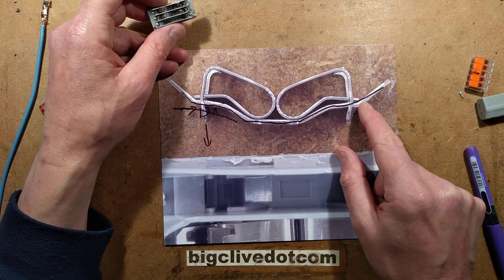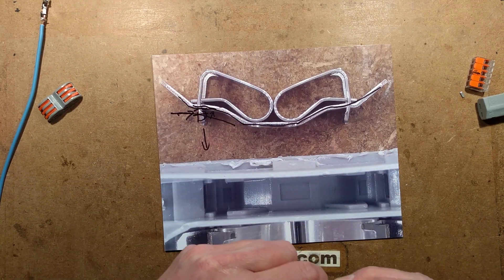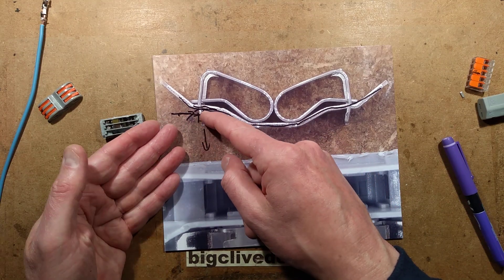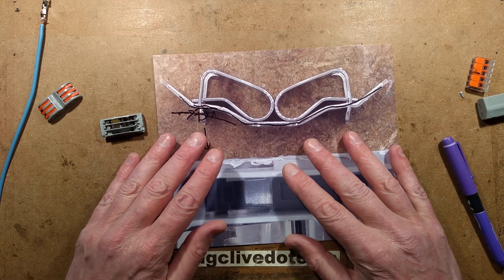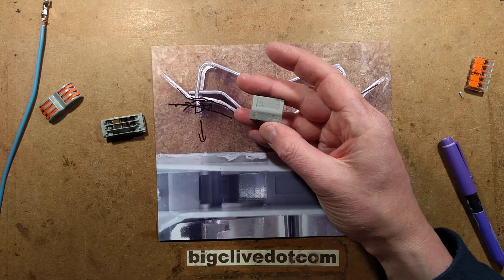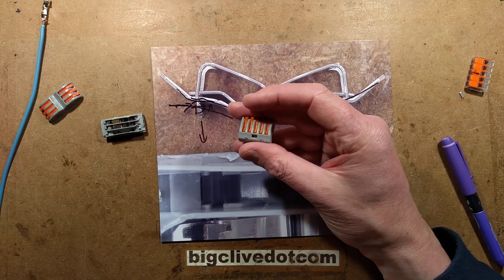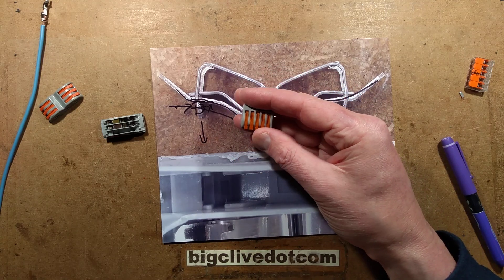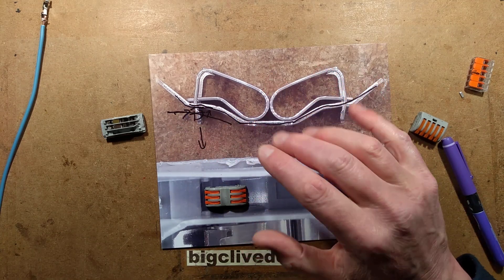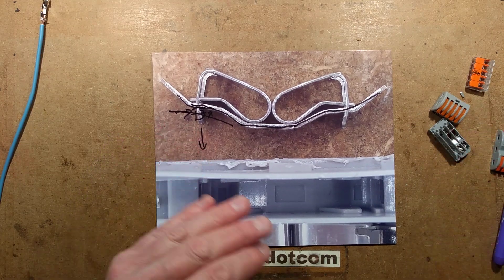It was way above the connector's rating, but it doesn't tell you the long-term story. You've got a conductor pressed against an unknown metal which has steel as a component - possibly some stainless steel variant - and you don't know how that connection is going to behave over time. An oxide or reactive layer may form between the two metals. I would always recommend that if you want to use WAGO terminals, they're not that expensive - get the original from a local electrical supplier, or Screwfix or Toolstation in the UK. What you're getting then is something that's been properly fully tested.